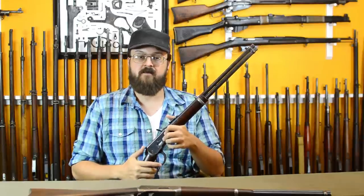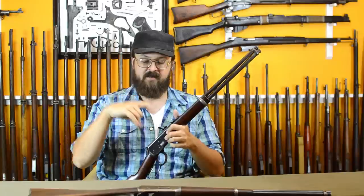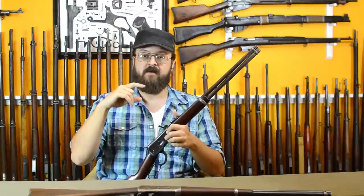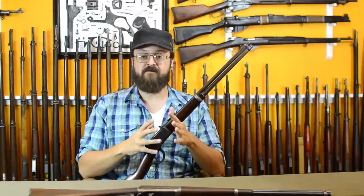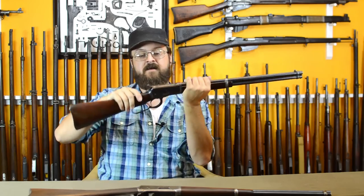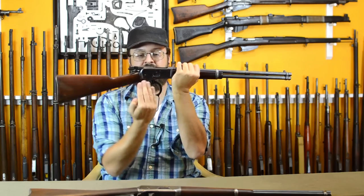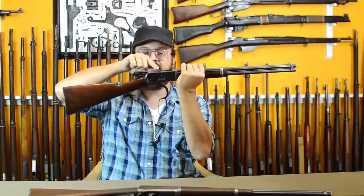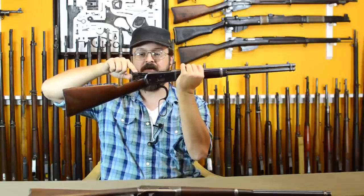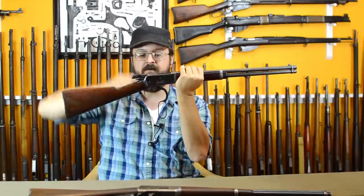So what they needed was a way to go ahead and put a longer cased cartridge in this action, just as powerful locking up, and yet there's a hesitation there, because if we open this up, you will see this is where our lever ends up on our stroke, this is how far back our breech block goes, and that's sort of it. If we want the breech block to go back further, we're going to have to open up